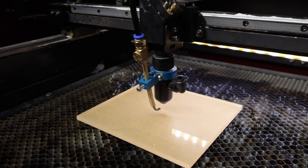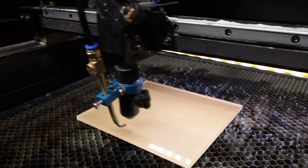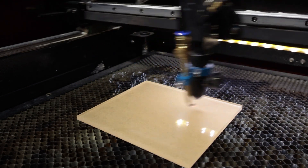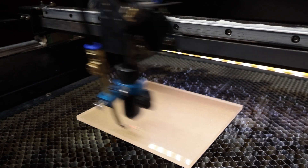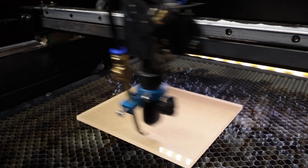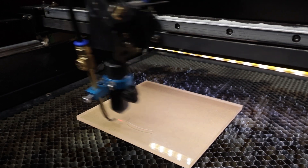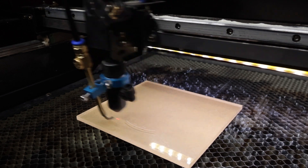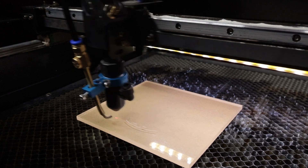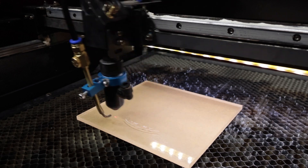Here we are in the laser. I have the external air assist hooked up. The air hose is hooked to the external air assist for now because we're going to run the first part of the image with the external air assist, and then for the second half we'll put it through the nozzle for the internal air assist. The external air assist is aligned properly — the outlet for the hose is beneath the nozzle. You don't want it to hit the nozzle because if it does it'll start melting the nozzle. But it's facing 90 degrees to the back.